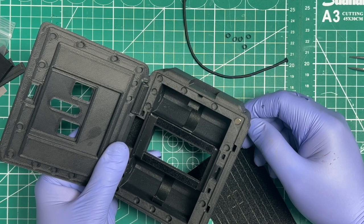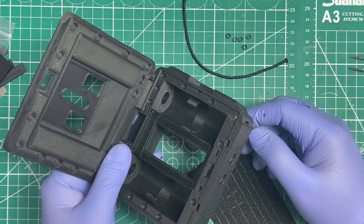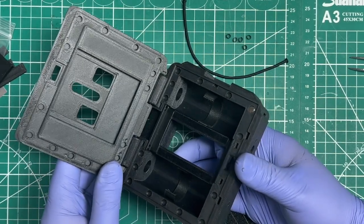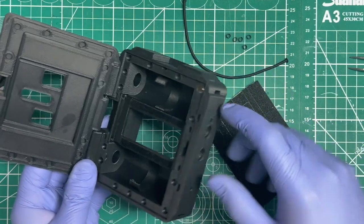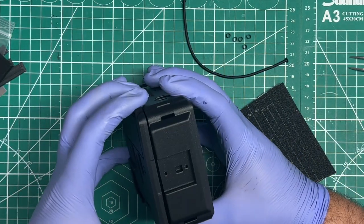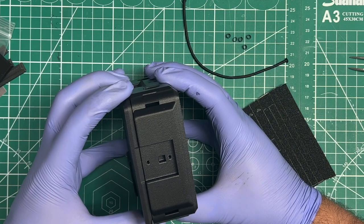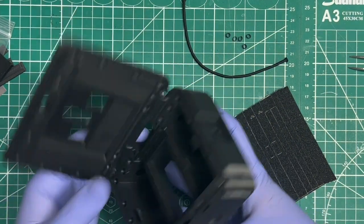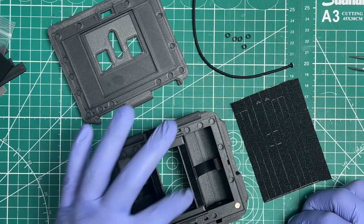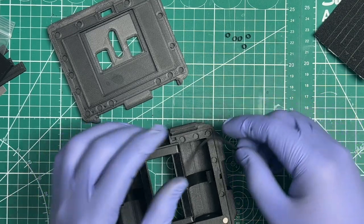But this is much better to me than a hardware hinge that doesn't have any flex in it, which means that if your dimensions aren't right when you close it, then it can crack or split or whatever. And the other thing that this allows, along with a little bit of give in the spring and the lock, and along with these foam seals when you add them, is that you basically have a back door that itself is one entire pressure plate. It's got enough play in it, so you know it's got some give. That's the point of this door, why I made it that way. Film flatness is pretty good, and it's a small area too, so it's not going to have too much difficulty staying flat.